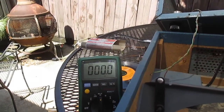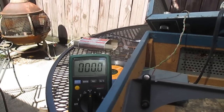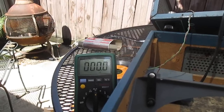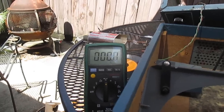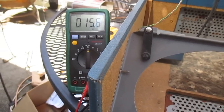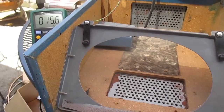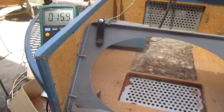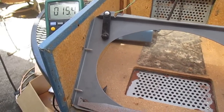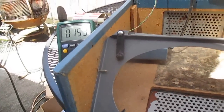The reading was probably a pretty accurate representation of the DC resistance of these three speakers wired in parallel — not good for the amplifier. Here's the speaker I'm going to try. It has a DC resistance of about 15.6 ohms, so this would be considered a 16-ohm speaker. That would be preferable to basically a 1.5-ohm load. We'll try it and see how it does.